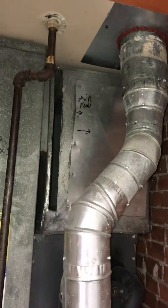As far as gas is concerned, there is an older isolating valve with the drip, so that's good. You can see the electrics coming in, which are in a sleeve. The drain starts in vinyl, so we'll replace that, and then it goes into PVC and probably drops down to a drain in the basement.